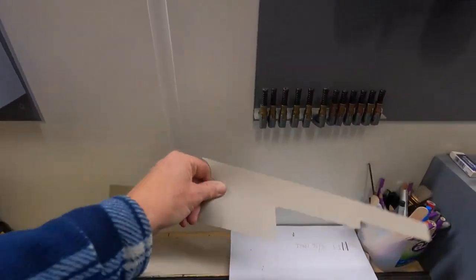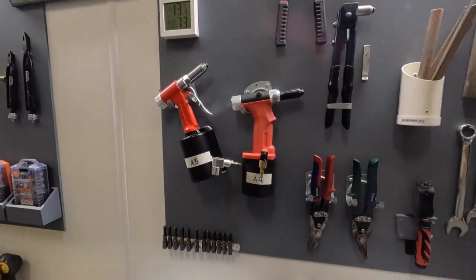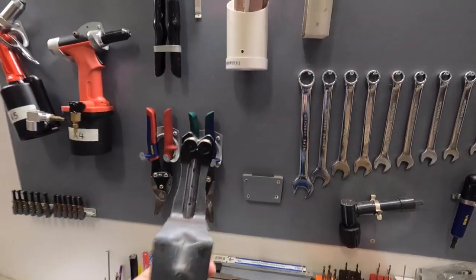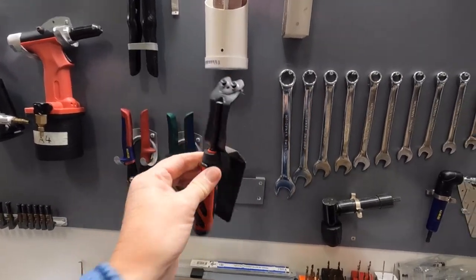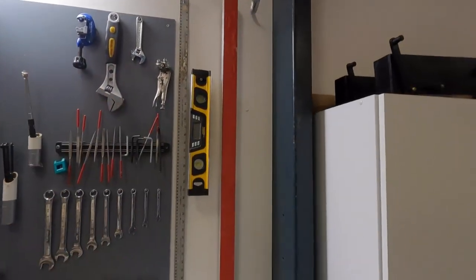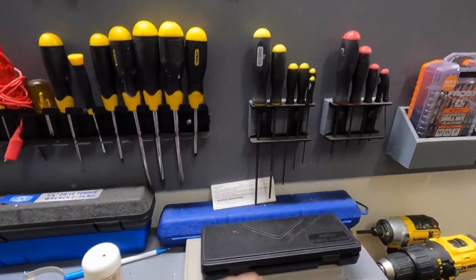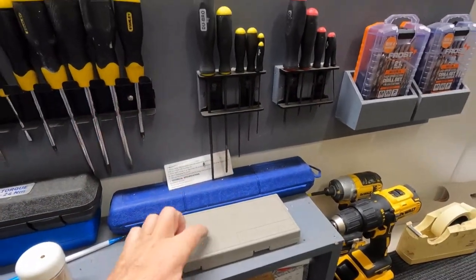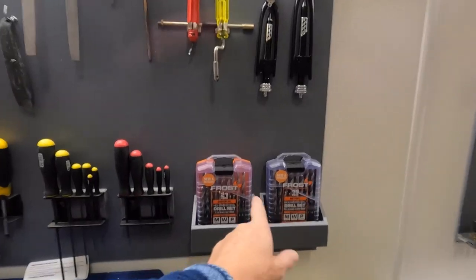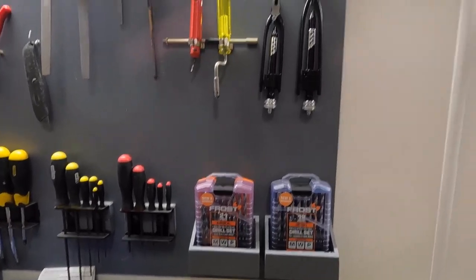Simple things like cardboard for templates comes in handy. Masking tape. Two rivet guns. Tinsnips — started to use those more on this build. An edge-deburring tool — completely useless. Hand riveter, swaging tool, hacksaw, some straight edges, long rulers. Vernier callipers — I've got three: the real cheap ones, the analogue ones, and the digital ones. Allen keys. Full set of metric and imperial drill bits — they come in handy for working out hole sizes too, just grab the drill bit — use them as a go/no-go gauge.